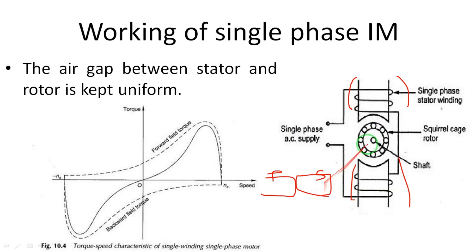When the secondary winding is short-circuited, it becomes a single-phase induction motor. When supply is given to the primary winding, alternating current flows and alternating flux is produced across it. This flux links to the secondary winding and induces an EMF in the secondary side due to the mutual inductance principle — that is why it is called an induction motor. Since the secondary is already short-circuited, current flows through it, producing alternating flux in the secondary.